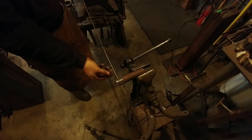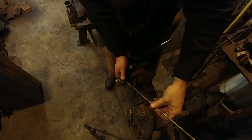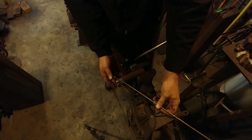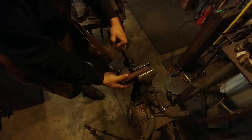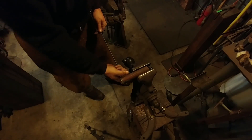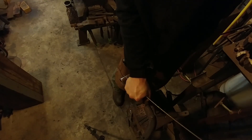Since this is just mild steel, we are actually going to wrap this cold. You just take and bend it around. This will work for small mechanical springs — that's what it's mainly good for. You just roll this thing right around. You have to have the notch in it so you can capture the end of the spring.